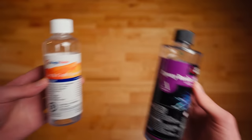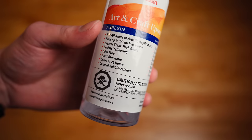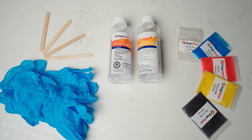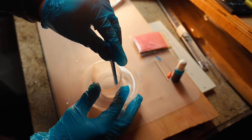Alright, let's finish these dice. For the resin, I tested Magic Resin and Let's Resin — both fairly similar, but Magic Resin specifically mentions bubble release and did seem slightly runnier after heating, which meant fewer bubbles. I also liked that it came with everything you needed to get started: gloves, silicone mixing cups, stir sticks, and color powders. Even though the bottles are smaller, you still get enough to make six full sets of dice. I found that mixing with a silicone stir stick makes a slight difference in reducing bubbles over wooden stir sticks.